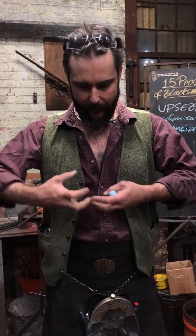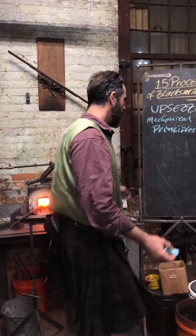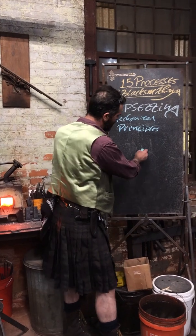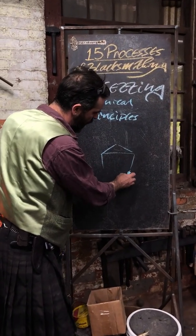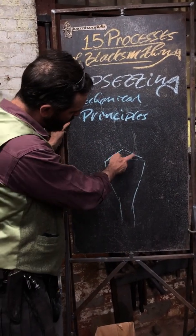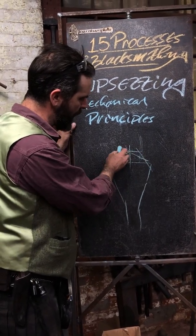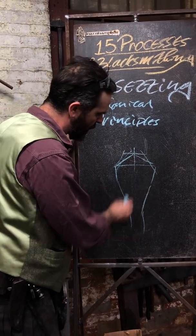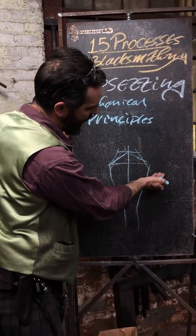So as we're upsetting ourselves by hand, we have to be aware of what is happening with that material as that face pushes in, making sure that we are transferring the material. In the last one I talked about the creation of that pyramid on the top as you're pushing in, because it's a bit like putting that longer flat end point in. It helps center up the energy a bit and it stops that flaring out of the cheeks.